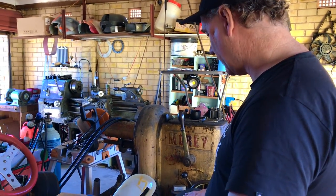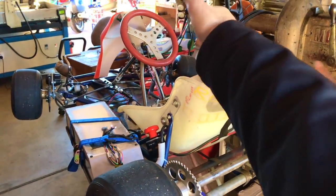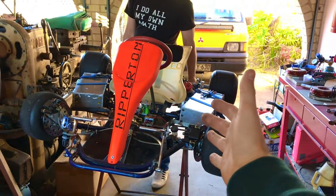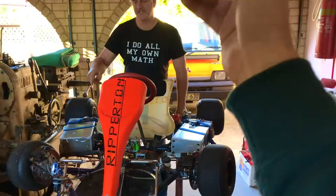We're not gonna have any scrubbing going around corners. When we go around a corner, we won't have to lift up the inside wheel. So what happens to a normal go-kart? When you steer left or right, the whole frame is twisted. A normal go-kart corners on three wheels — it lifts up slightly off the ground.